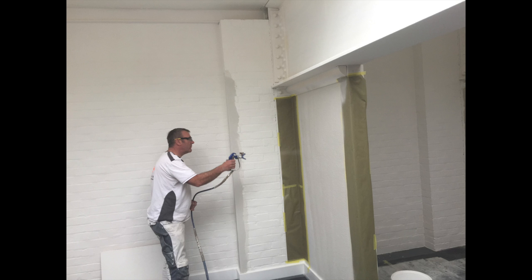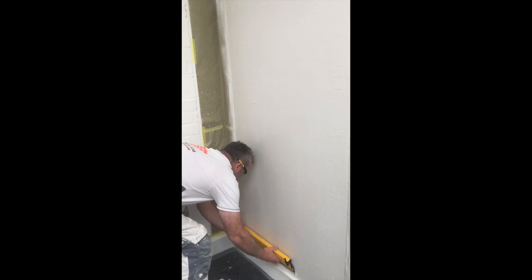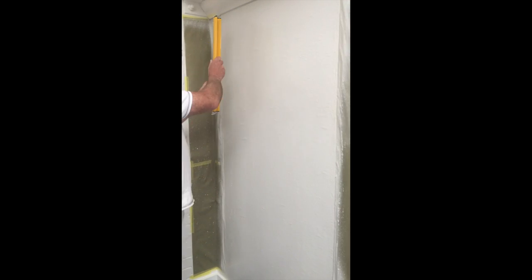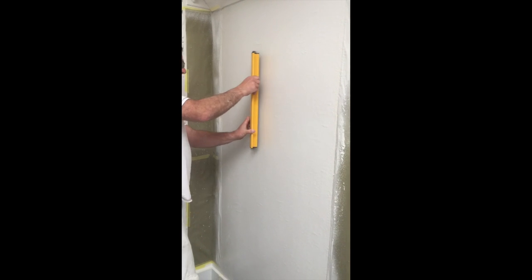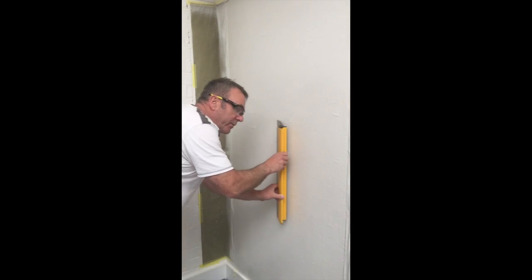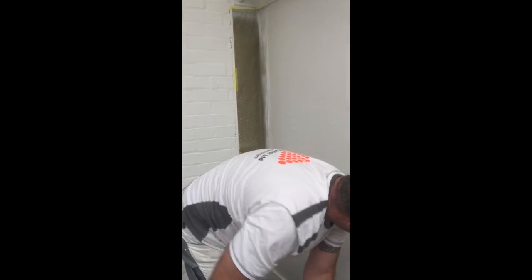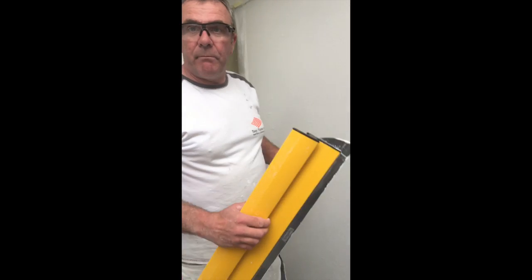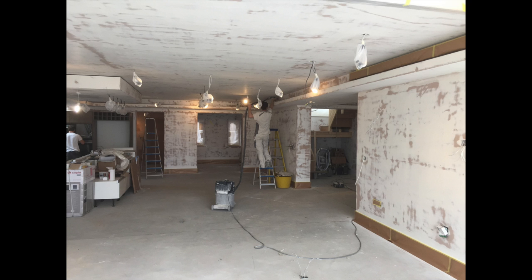Plaster can be used to cover Artex, wood chip, brick wall — pretty much anything. Because it only has 10% water content, it doesn't lift anything, it just dries. The binders hold it all together. It doesn't need priming — you just spray it, level it, trowel it and leave it to dry. Give it a light sand, job finished. Yes, we have to sand it, but I'd rather sand this stuff than sand the plaster walls I've been working on over the past few years.